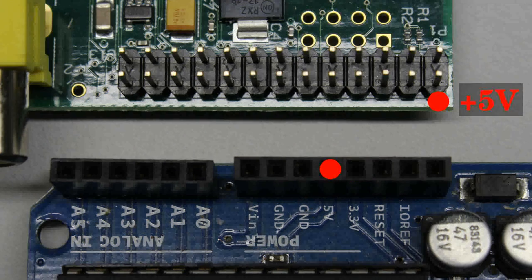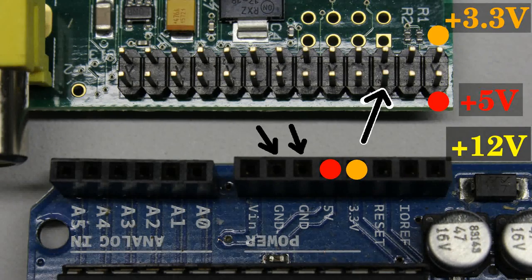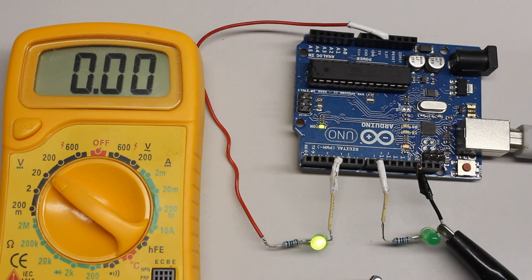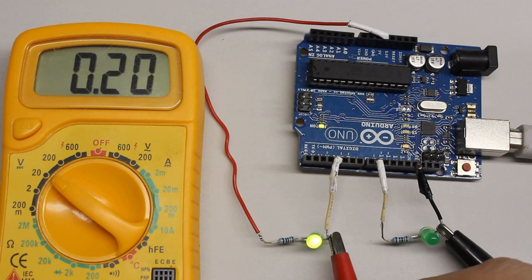Because of the importance of the voltage, the cables are usually marked by color codes. At computer power supplies, orange colored cables are used for plus 3.3V, red cables for plus 5V and yellow cables for plus 12V. The negative terminal, also named ground, is the reference potential and so the most important cable. It is always marked as a black cable. All pins are initially turned off, thus there are almost 0V between ground and each of the pins.